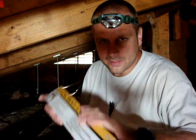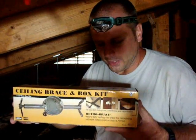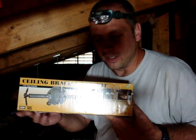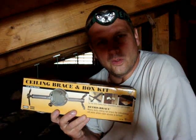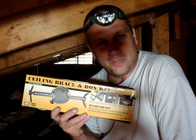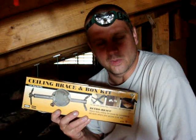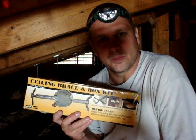So I'm crawling up into the attic today to fix the ceiling fan. This particular box is made for tight spaces and retrofit work — it's about $15. The same company makes one for new construction work, about $9. But the important thing is you have to put in a box capable of holding up the weight of the fan. The box you buy will have weight ratings on it — they'll say up to 35 pounds or up to 50 pounds. It's vitally important that ceiling fans get hung from properly supported boxes.